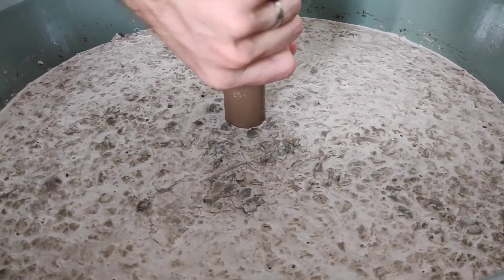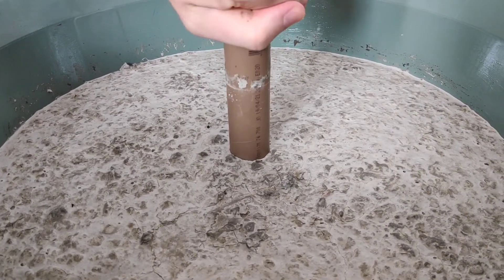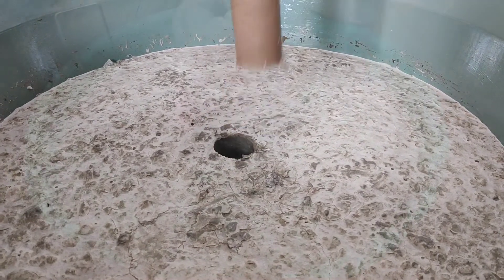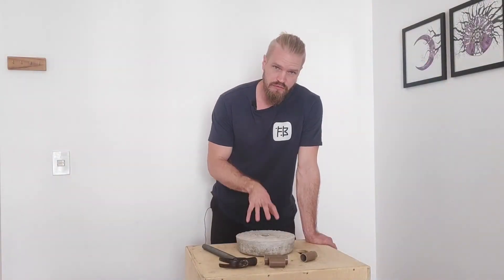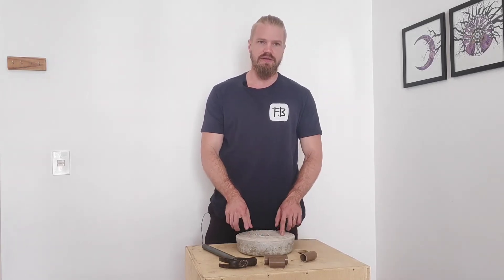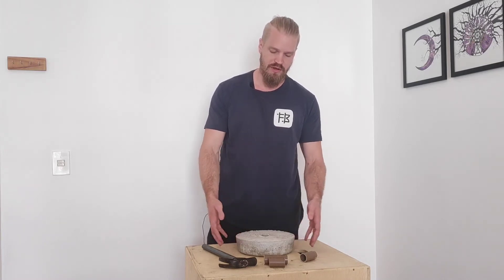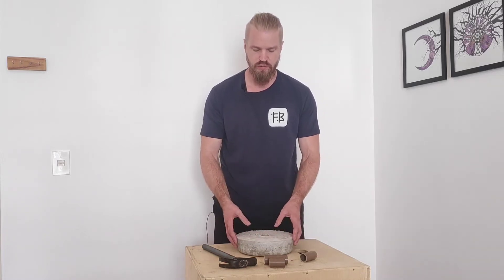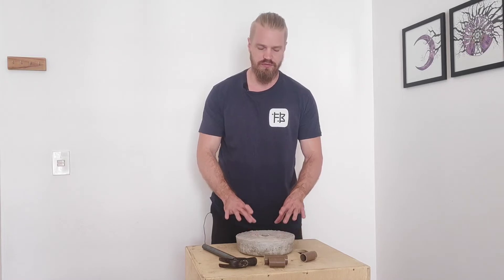I'm using a rotational movement to pull the PVC pipe out — I found that was the easiest way. I also left the PVC pipe longer than strictly needed for the mold, just to make this part easier. About two weeks have transpired since we started this project: the first week it was submerged in water, then after a week it came out to cure. At this point it's cured mostly, has lost most of the water weight, and will continue to gain strength. It's good enough to use.